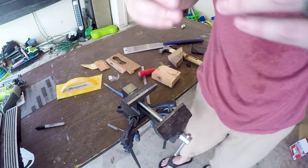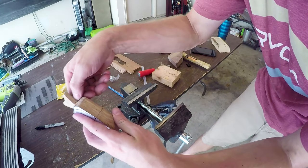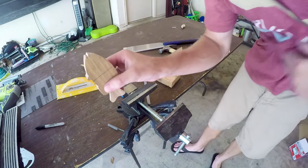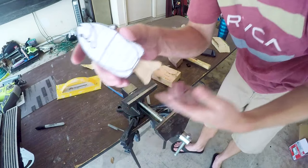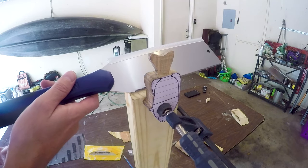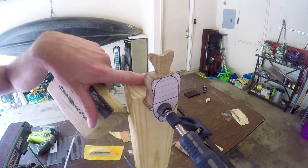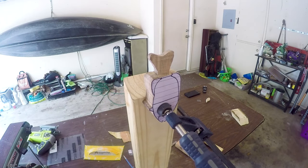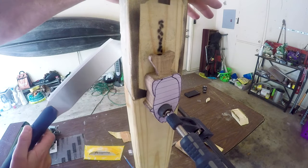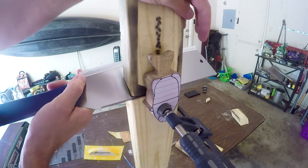Got his little tail cut out. Obviously I'll have to do the rest for the whole body but he's gonna be a fat little bluegill. So I'm gonna cut the joint now right here and right here. I'm gonna go ahead and cut halfway through — or not halfway but almost halfway. This is a 30-degree angle that I cut on a chop saw, and then just use the other side to keep it level, so whenever you're cutting through you put this on top of it to keep it cutting through the same angle.